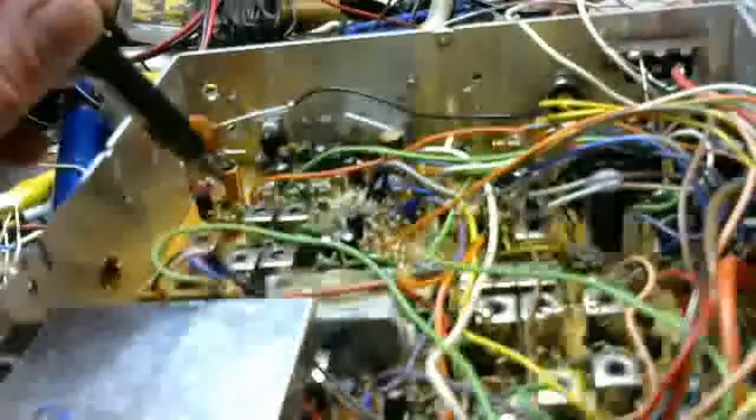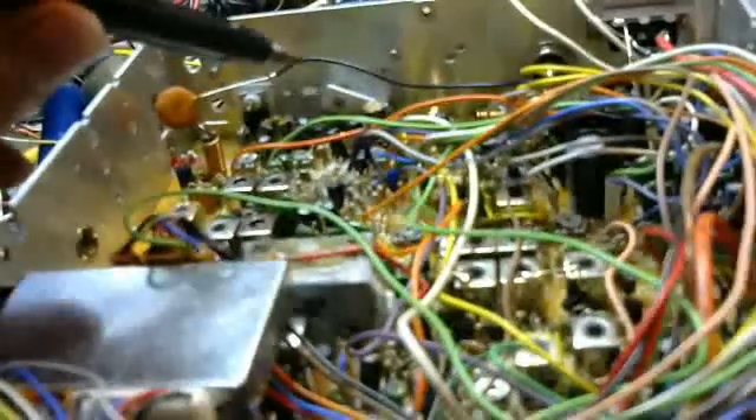Let me give y'all a quick look at the main board here — don't laugh too hard at my work, there's a lot more I've got left to do. I'm using the 2SC1973 pre-driver that was originally in the radio as an RF driver. This capacitor here — there's no LC tank circuit yet. I'm using the antenna tuner as an LC tank circuit.